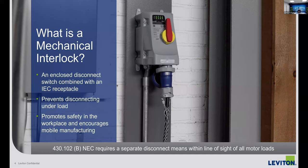We're seeing more and more of these in food processing and industries with a safety focus. The other area where mechanical interlocks are really starting to pop up is portable manufacturing. Think about a food processing facility — somebody makes one particular piece of food today, wants to process something else tomorrow. A mechanical interlock housed around your facility allows you to drag equipment to a location, plug it in, energize it, do what you have to do, then turn it off and roll in something new. Large facilities can work with the space they have.